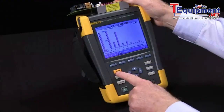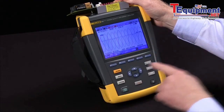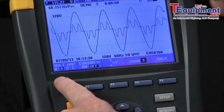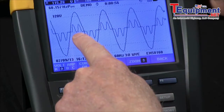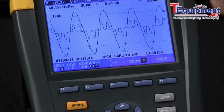To see these signals, I can hit the scope button and toggle over to the scope. I can switch to amperage and over to a phase. I can see phase A, my voltage being the larger sine wave, and my current waveform being the double hump that shows a three-phase power supply.